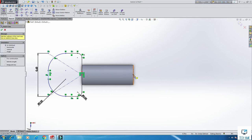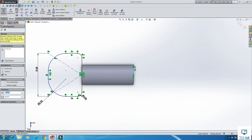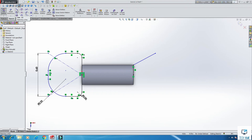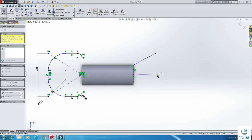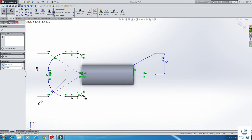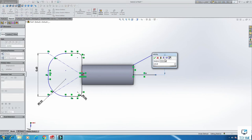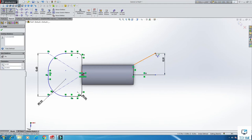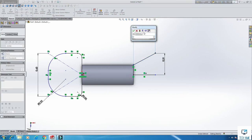Take a line here. This point, this point. And same as before, this point. From a smart dimension, take another line up to this. Okay, from a smart dimension, make the difference this point and this point, it should be 0.625 divided by 2. Okay, 0.31, and the difference between this point and that point is, okay, this point is 1.25 minus 0.737. Okay,